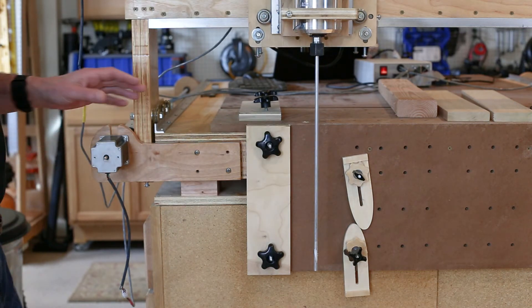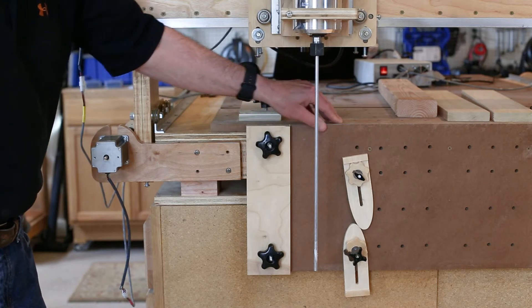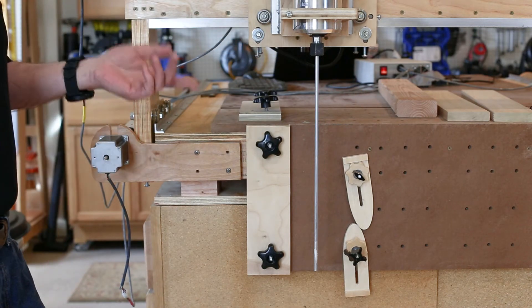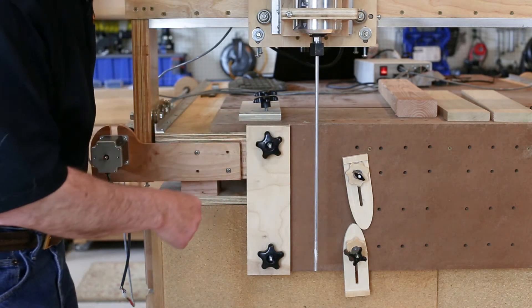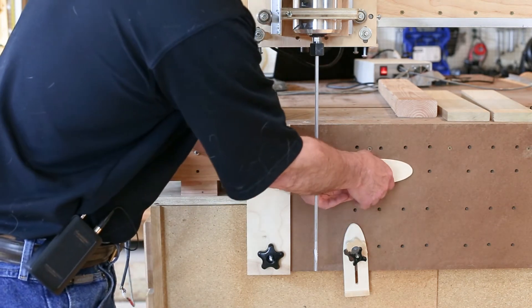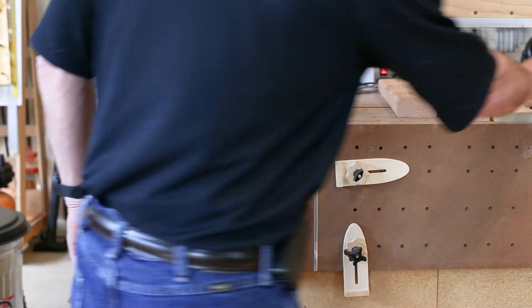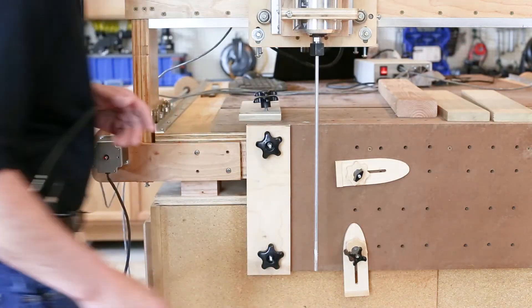Here's the fixture I use. I put a piece of three-quarter inch MDF on the top of my router bed and another piece of three-quarter inch MDF perpendicular to that, aligned so it was perfectly perpendicular. I drilled some holes in the MDF, and on the backside are the quarter inch T-nuts I use to attach my clamps. I have these homemade clamps, and the holes are drilled so I can use the maximum throw on them. I tighten these clamps against the material to hold it perpendicular, then use Rockler aluminum clamps to hold the piece down.